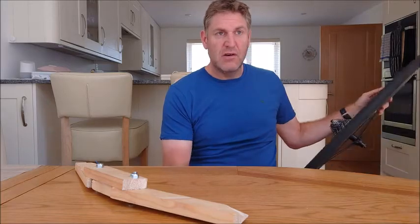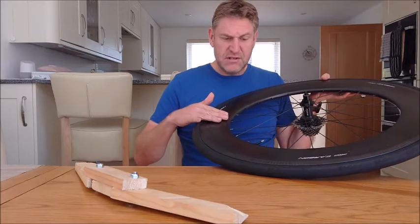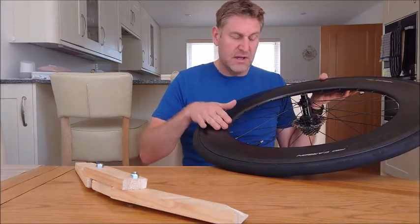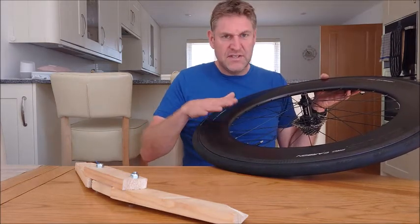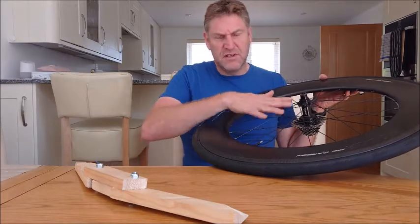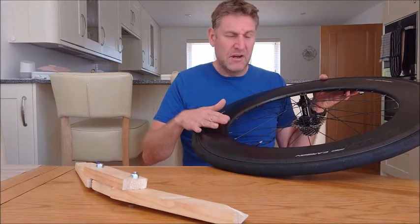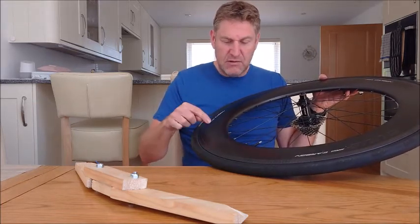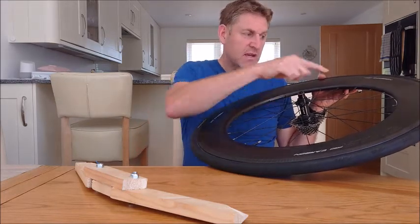Now that's great. I also need to work out what radius I need. I could use a conical one, which I've currently got, or a dished one which is called lenticular. That's a little bit stronger because there's no flat sides, and also a little bit more aerodynamic. So I was going to go with the lenticular one. I need to work out what radius touches the point here, here, and here.